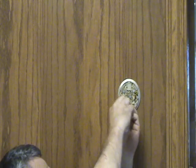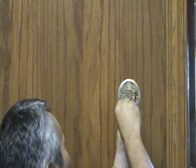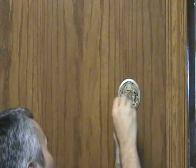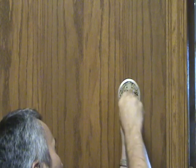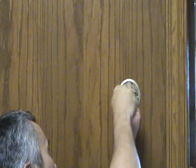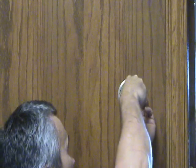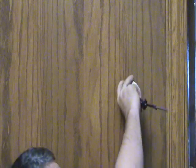To continue with the replacement, mark the wires, colors, and which terminal they came from, then disconnect the wires. You want to remove the sub base from the wall — usually there are two or three mounting screws. Take them out and the sub base itself will come off the wall.